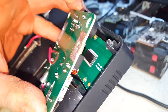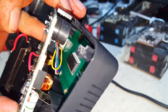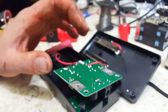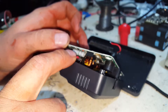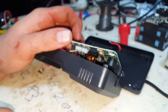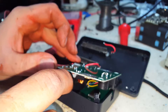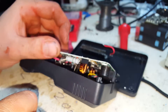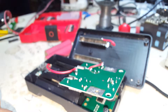That's what we're going to remove. So heat the soldering iron up, unsolder these two, pull that little siren off the top of the board. I could just put a bit of glue inside the top of it or tape it or whatever, but let's get rid of it. Inside we've got two reasonable-sized resistors — probably five watters or something like that. There's a digital display and a big IC to drive it at the bottom. Connected by a cable that goes between the two. Power in at the top, power down to the USB port.